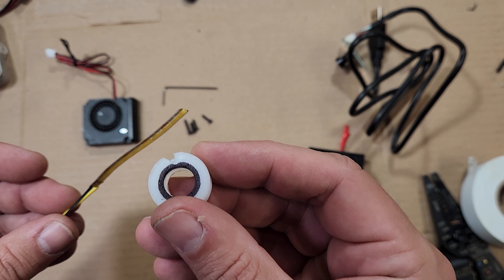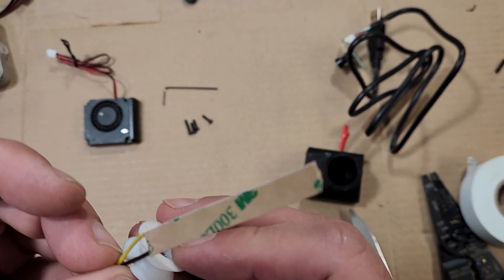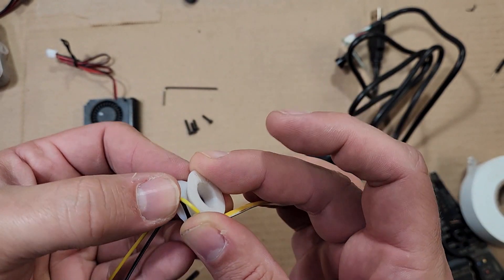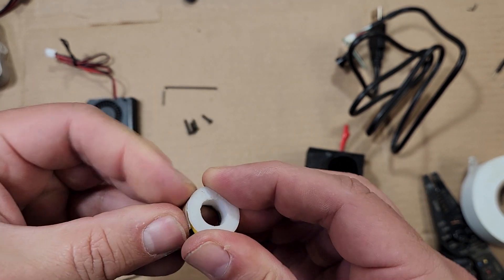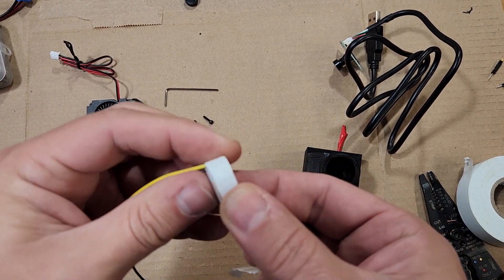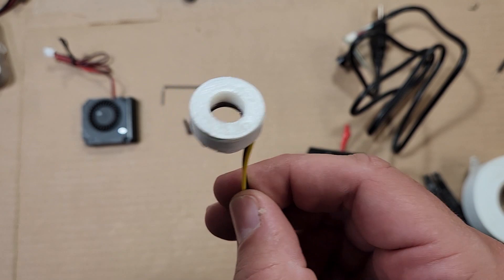What we want to do is wrap the light strip around the light ring. You'll notice there's a notch in the light ring — you'll want to align those two wires in that notch and give it a little bit of room, about a centimeter or so, so it's not making a tight angle on your solder connection. You'll hold this at finger tight, then come back with our piece of tape and wrap it up. You really want to stretch that tape as tight as possible. When it's done it should look something like this.